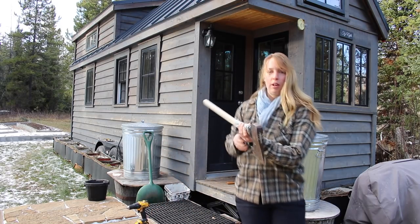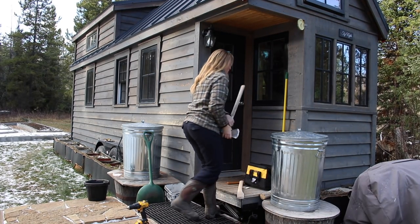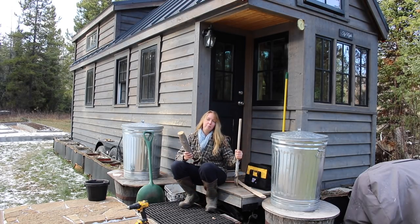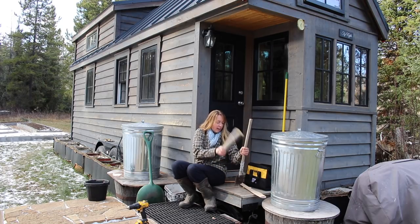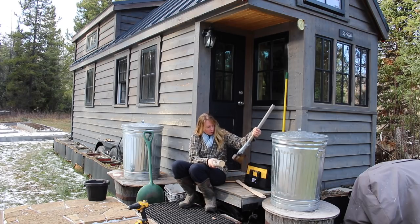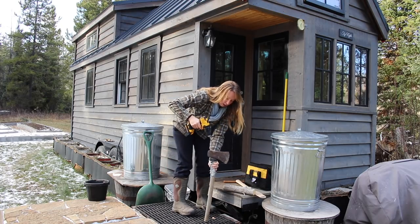Let's see if that's enough. If you can look straight onto the head there, see how I've made holes on both sides so that it will hopefully be loose. I might need another couple of holes to loosen it up sufficiently. Now I want to tap this off, and I don't want to use a steel hammer to hit this, because when you hit hardened steel with hardened steel you can cause really funky fracturing. So I'm going to see if it will tap loose with my chunk of firewood. It shifted a little, so I probably need another couple of holes.